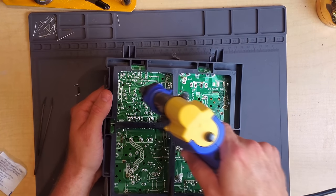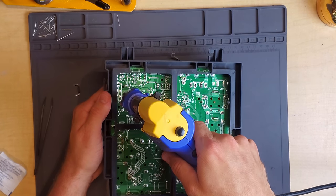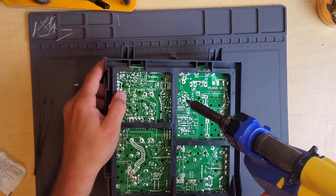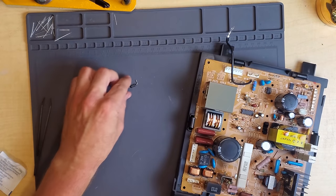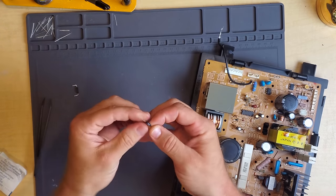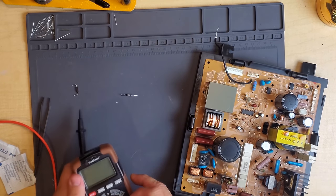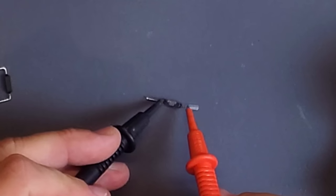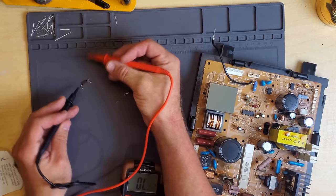Our tool's ready to go here. So I'm going to start by just heating up these points and getting rid of that solder. And that's pretty loose - the old fuse will just fall out. And we can take a look at it. See, there's no real visual indication that this would have blown, so you would never know unless you did a continuity check on it. So just to show you for sure that this one's blown, we can go ahead and double-run that continuity check - and we should hear noise. We're getting nothing as I probe those.